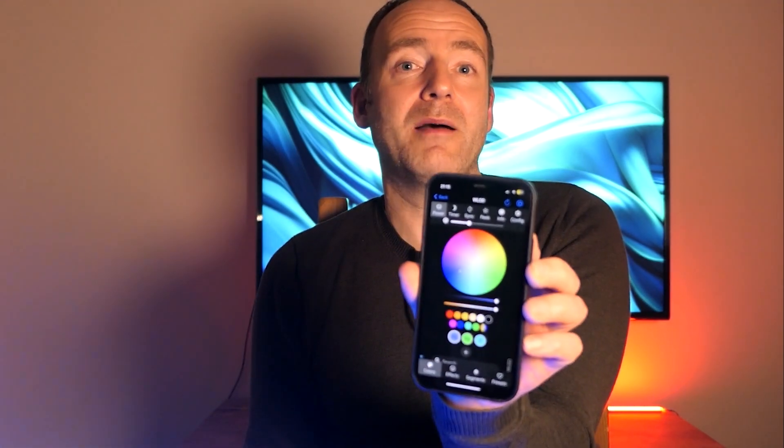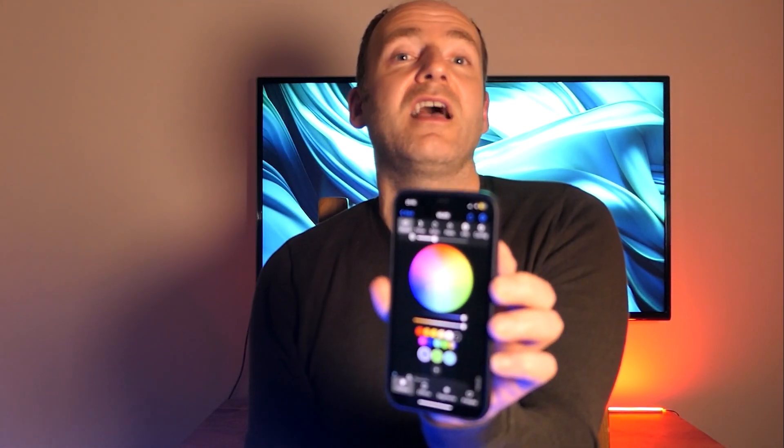Here I have a homemade light - you can see the individual LEDs, it's a COB RGB strip in a diffuser. It's got a USB battery pack inside and it's completely controlled by mobile. I can change the brightness, add gradients, and do all sorts of cool stuff using the WLED application, which is free to download and install. You can really get some cool lights in like five minutes, so keep watching and I'll show you exactly how to do it.